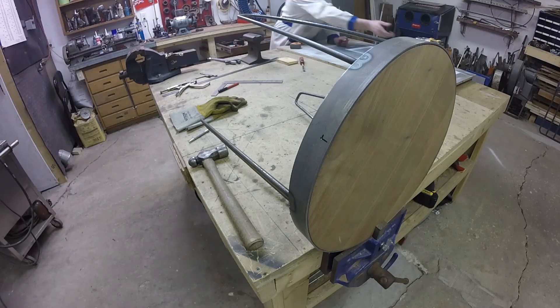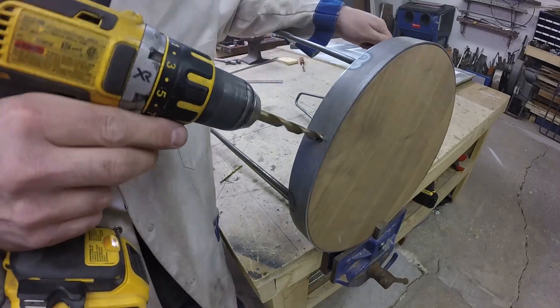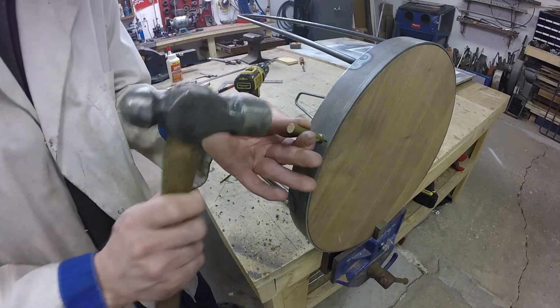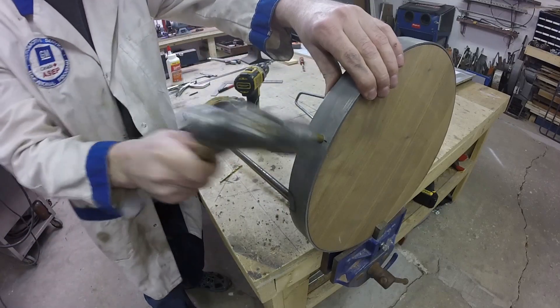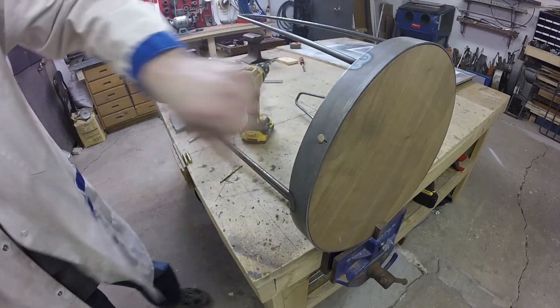The wood is only press-fit into that ring right now, and it's probably going to shrink over time. To combat this I put in three brass dowels, glued into the wood, placed between the legs at three points all the way around. This actually locks the piece of wood in there and gives a neat look — almost like a rivet.